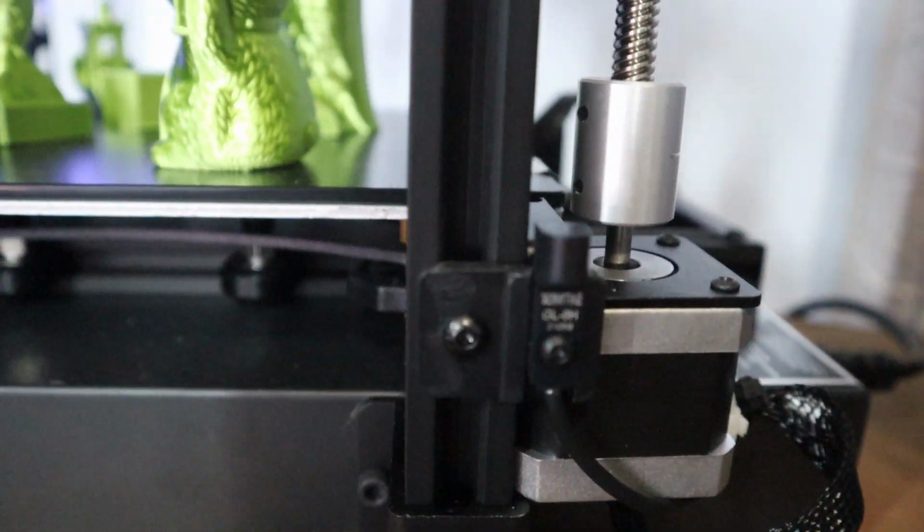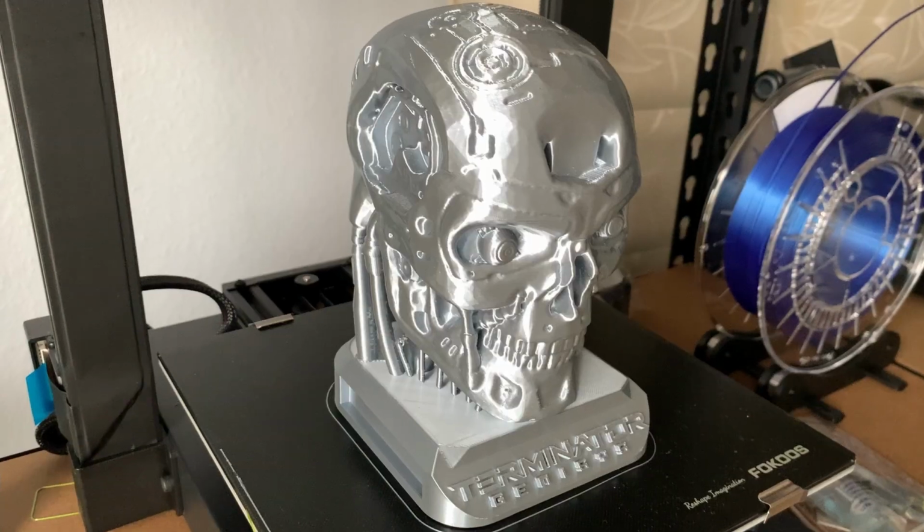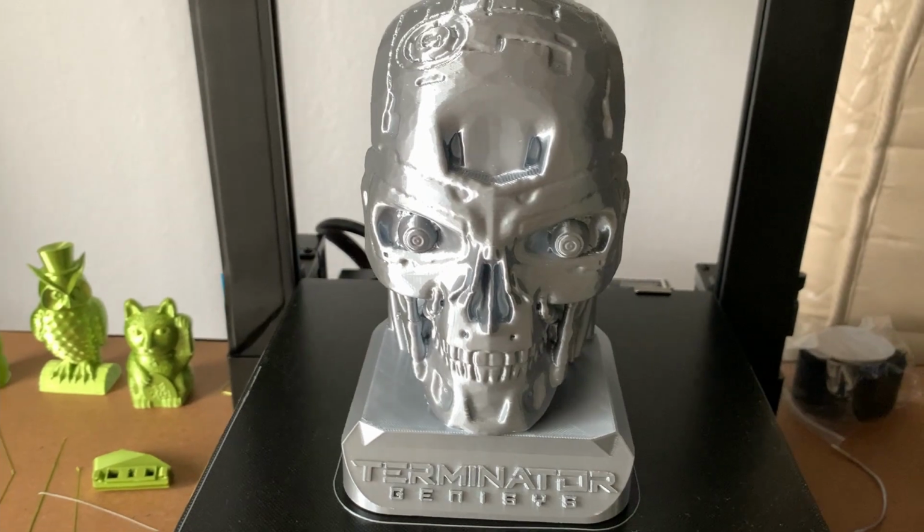Thanks for subscribing to this YouTube channel and answering the question from Andrew Smith about the Flashforge Adventurer 5 3D printer. Which kind of filaments can you use on this 3D printer? Well, on the site from focustech.com, they state that this 3D printer can print something like PLA, PLA Plus, TPU, ABS, and PETG. But the most recommended filament types to use on this 3D printer are PLA and PLA Plus. It's most ideal, and I hope that this answered your question. So yes, you can use PLA and PLA Plus, but if you are going to use PETG on that glass bed, make sure to have some layer in between, like glue stick or some other layer in between your print and your glass bed, or else your glass bed will break after removal of the PETG model.